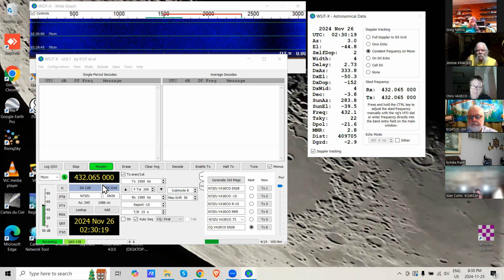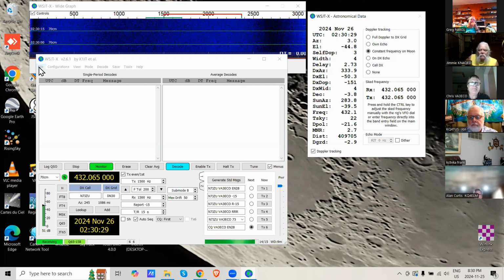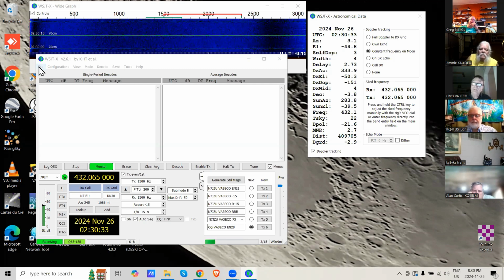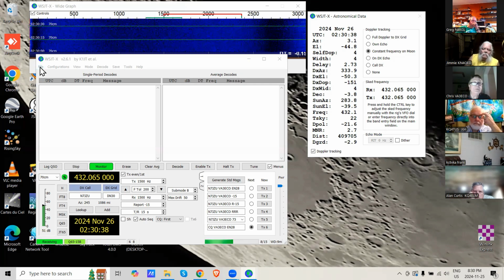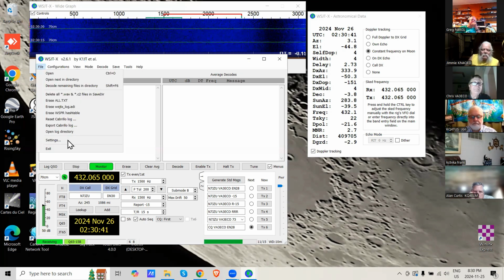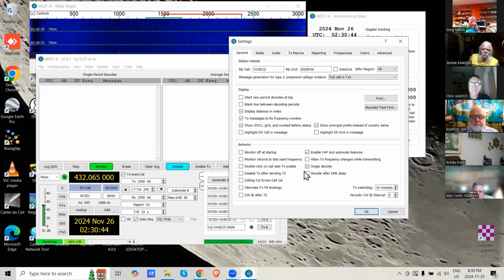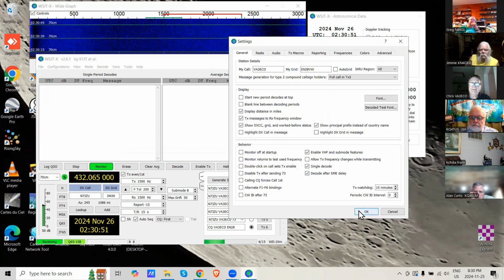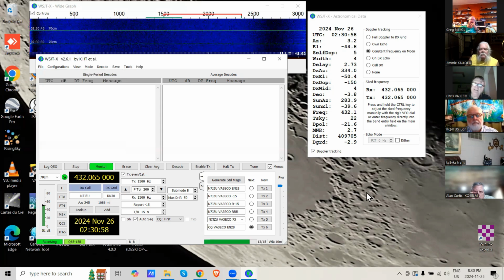The delay I'm talking about, the 2.5 second delay, that's not automatic. Just because you're working Q65 doesn't mean you're doing EME. You could be doing aircraft scatter like Greg and I did between Panama City Beach and Dothan 2 years ago. It's here, File, Settings, General, Decode after EME delay. Click. Okay. Don't forget to click it back when you start doing FT8 the day after.